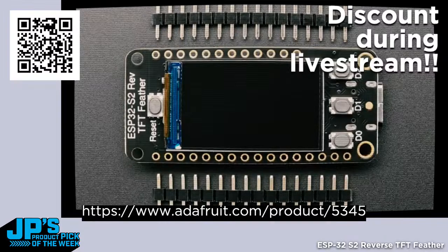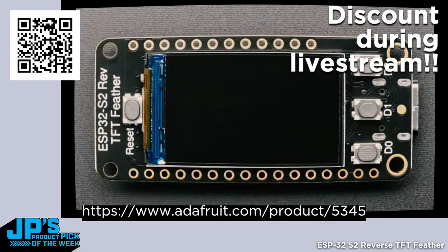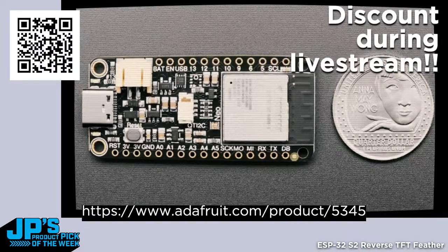It's a 240 by 135 pixel RGB TFT with IPS, so it's a very beautiful little display. You communicate with it over SPI. You've got the reset button and three IO buttons, and the D0 button is also the bootloader button. So if you ever need to enter the bootloader manually, it's also available. So you've got on the left, the USB-C, you've got another reset button in case you need another reset button. I always like to keep it there.